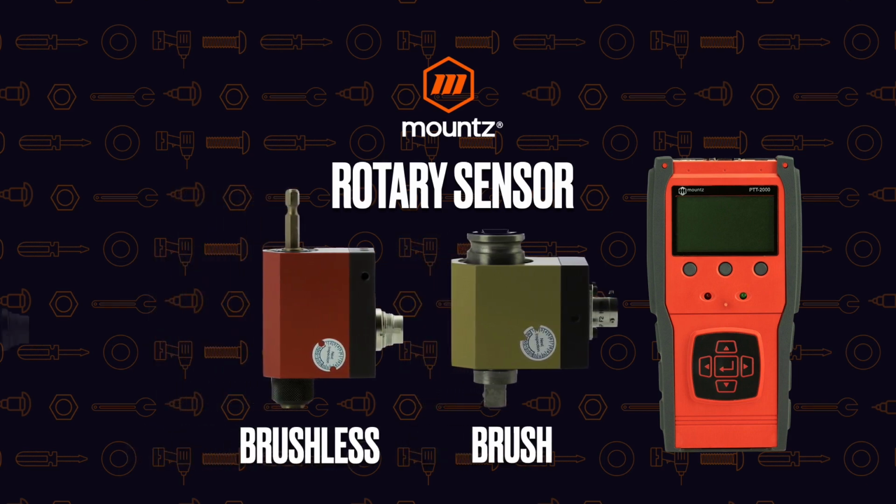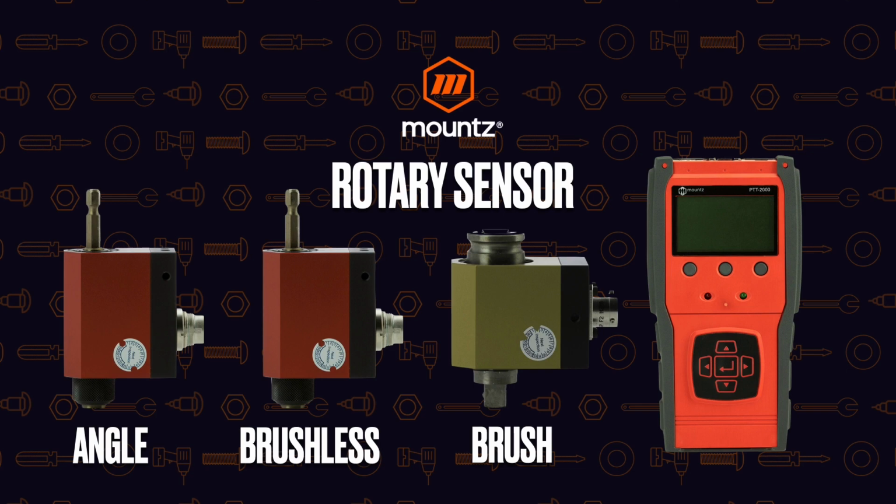There's also one additional style of sensor, and this sensor not only will be able to capture the torque, but it also can provide an angle signal. So as rotation is happening, you can see what that torque value is based off of a certain amount of turn or angle, and you can grab that information from the sensor. So those are the different styles of rotary sensor, and again, these would all be paired with a torque analyzer. These systems are a calibrated item, whether it be the Z540 or an ISO 17025 certificate. So this is a calibrated piece of equipment that would need to be calibrated on a periodic basis as well.